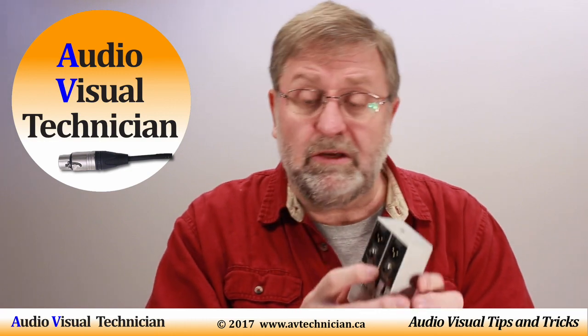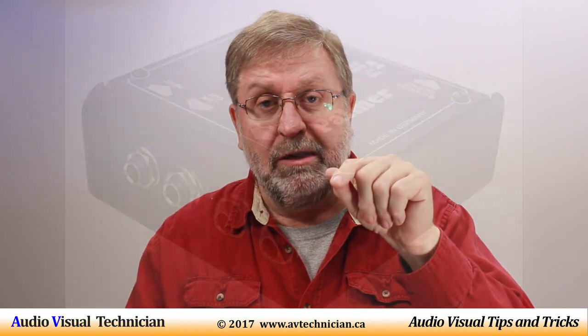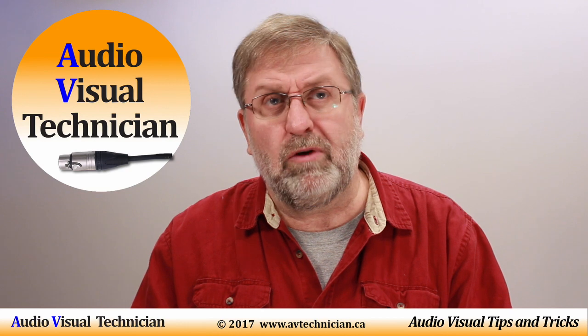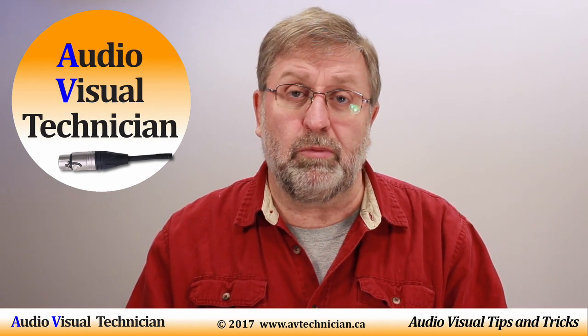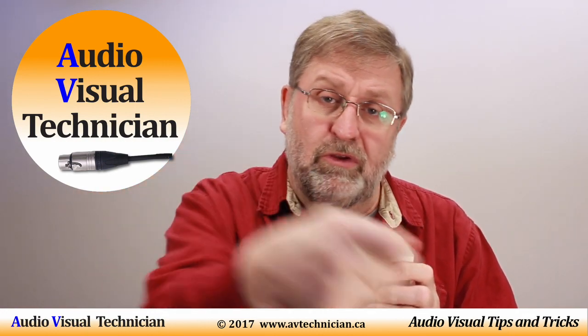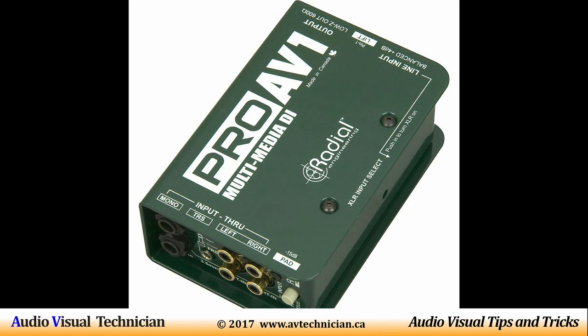Now this one, being on the lower end, does not have a pass-through jack. Some of the cheaper passive ones have an input where you put your instrument in, and then a separate output that passes the unadjusted signal back out so it can be connected to an amplifier on stage. This is almost a necessity because not a lot of guitar amps have an output you can hook to the mixer board. So the idea is: instrument goes into the input, and then the other jack feeds straight into the amplifier on stage. This particular unit does not have a pass-through, so it doesn't work that way — but I've seen a lot of the cheaper ones that do.